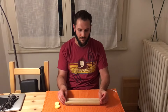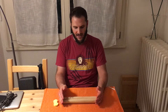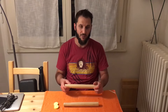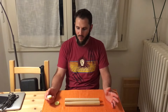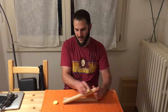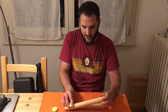At this point I'm really happy with how the sticks are. It's nice and smooth and this is absolutely beautiful wood, so rather than staining it I want to keep the same color but I am going to treat the wood. You could throw a coat of spray polyurethane on - it's very quick and simple - or do a stain and polyurethane coat to change the color. But a nice home hack is to use candle wax. Simply rub the wax onto the wood and then take a towel afterwards and wipe it off - it's a really simple process.